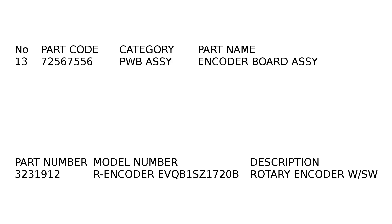Hopefully this fix will work out for you. If not, then you will have to replace the value dial. You can either replace the dial itself and solder it onto the PC board, or you can replace the PC board with the dial already attached. These are the official replacement parts you see here. The one on top is the rotary encoder already attached to the PC board as a single unit — this is an option if you want to replace it without soldering, as you will just have to attach it with the nut and close the unit back up. The one below is just the rotary encoder, which you will have to solder on to the PC board that you already have.